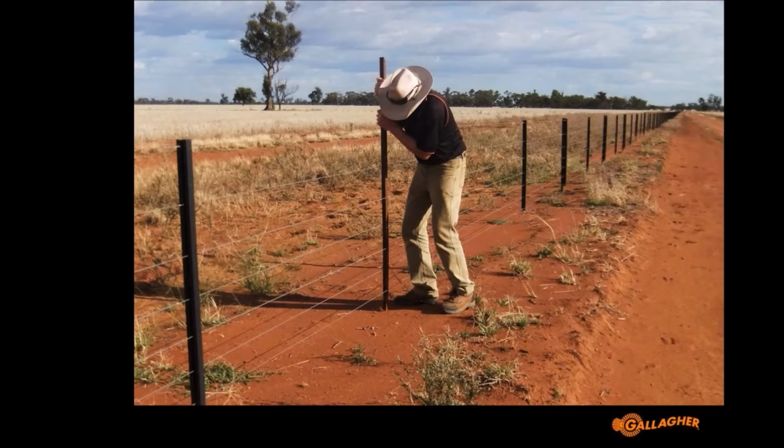And shown in this image here, this is in Australia obviously, what this man is doing is he's putting a steel stake between the wires, so he's shorting from live to earth. In areas with wetter soil, you can short just from the live wire to the earth using a steel stake or something else. You want to do it ideally some distance away from the Energizer, and that will make sure the Energizer is running at full power. Then when that's happening, you check your earth, because that'll show you how much power you are losing on your earth system under the worst case scenario when your fence is heavily loaded.